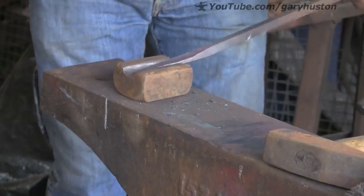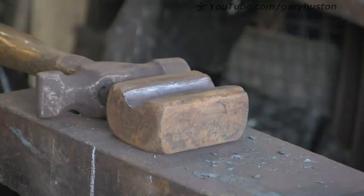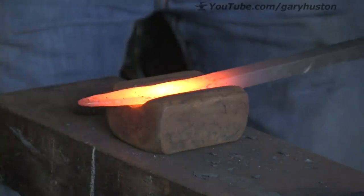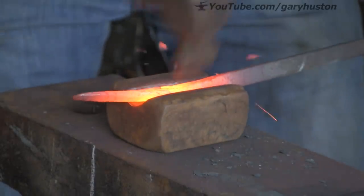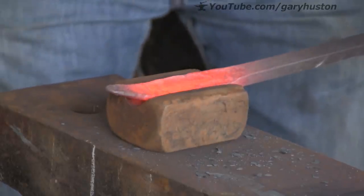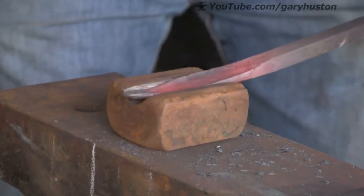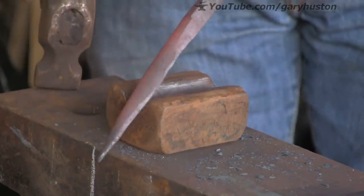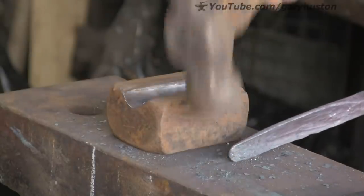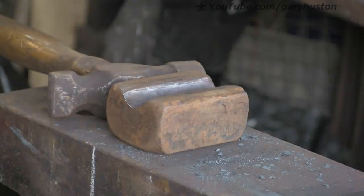Ideally I'd like someone to help me — they could strike and I could hold a bit of round in there, that would take half the time I think. Or have a power hammer. I want to come back, I want to make it — I'm not quite sure how long it is. You see that chalk mark on the anvil? That's how long I think I want it, about three quarters of an inch longer than the first one I did, which wasn't long enough. I don't want that taper to get too wide, I want to leave that fairly narrow, and it's going to have to get fairly thin as well.